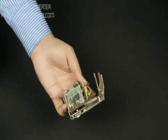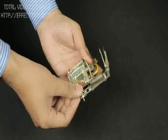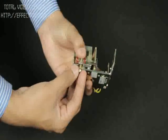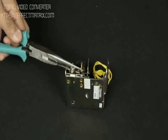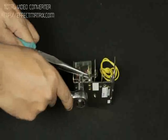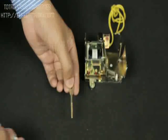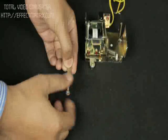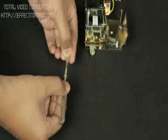Take the shunt release assembly. Fix the special pin to the striker by using a nylock nut. The connecting link is divided into two parts — insert a check nut in the threaded portion and then join the two connecting links as shown.